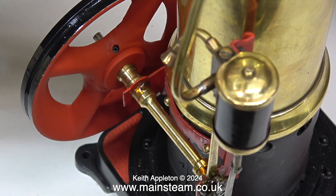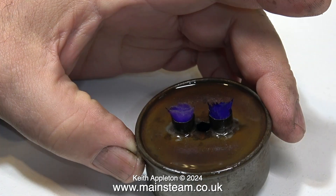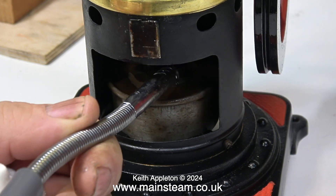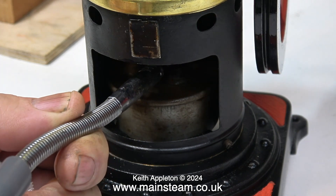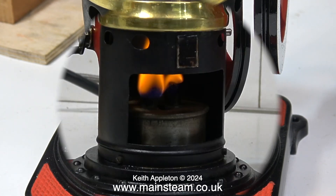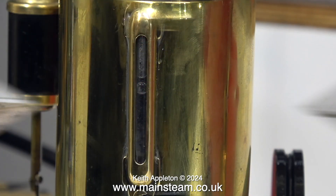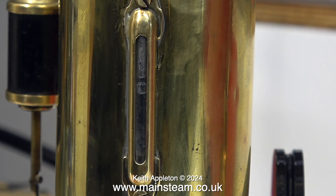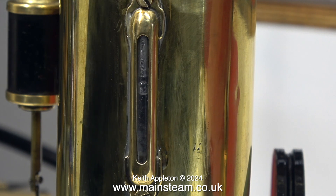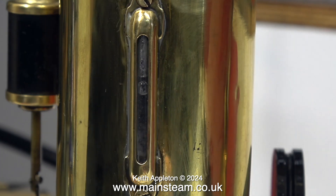But the engine seems to run okay, and it's not really going to be used for running — I would think this is going to be an ornament for the rest of its life. To be perfectly honest, with an engine of this age, I cannot recommend to the owner that he runs it anyway. Mechanically, the design of this engine is not very strong, and if you rotate the flywheel with pressure going to the cylinder, all of the parts bend — apart from the crankshaft, that's okay. During the last steam test, I noticed that the water gauge was leaking down the left-hand side, so I used some JB Weld to fix this, but now it's leaking down the right-hand side.